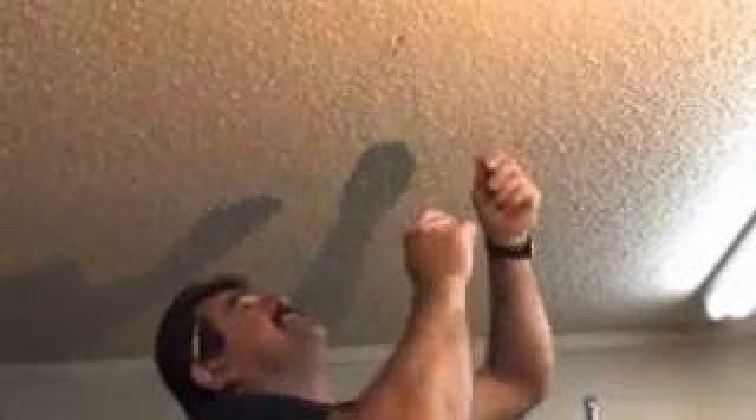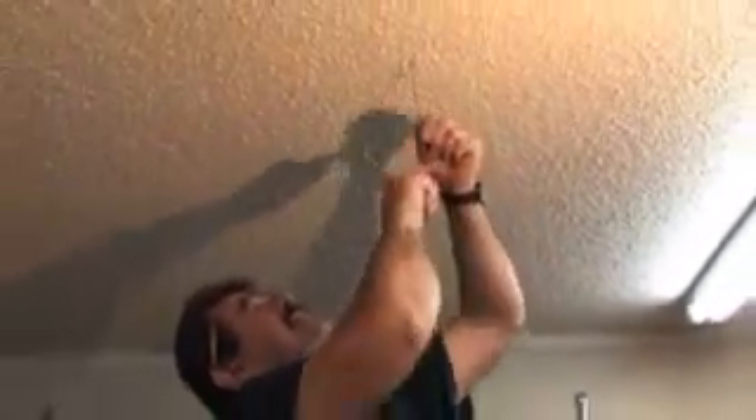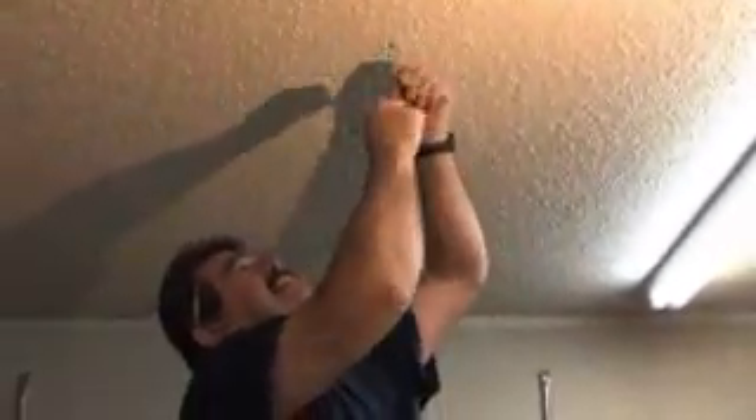By sticking it to a piece of wire, or just a wire coat hanger, we're going to move it around and determine there's nothing in the way. What we're going to do now is drill a hole through the ceiling all the way through the roof. That way when we get up on the roof, we'll know exactly where the skylight needs to go.